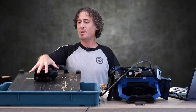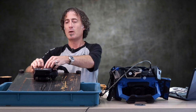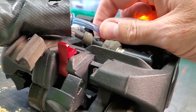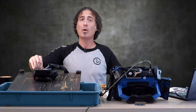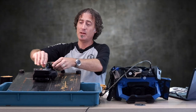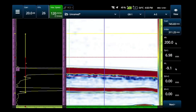We put the Hydroform on the test piece. Then what you have to do is make sure that the probe is sitting down against the part. You have to release this lever on the back side and then push the probe gently down so it squeezes that gasket — that will keep that water column in place. Now's the fun part: we get to turn on the water. What you're going to do is move the Hydroform back and forth to kind of work out some of those air bubbles.